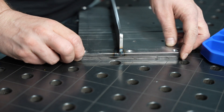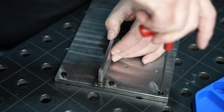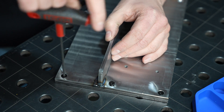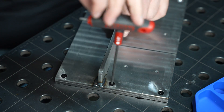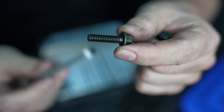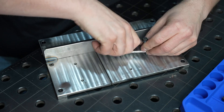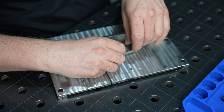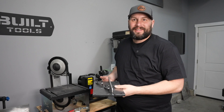I'm laying out my hardware — some sort of tray is a must-have with a fixture table because dropping fasteners through the holes can be super frustrating. The fasteners sit down in the countersink for a flat face on top, and I got a length so they line up flush with the bottom as well. I'm using flanged bolts for the toe clamps — these give a good contact patch on top without needing washers. One bolt through the center and one on the back to pivot it down to hold things, with pretty good reach across those four holes.